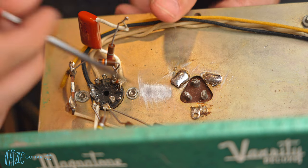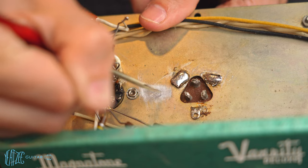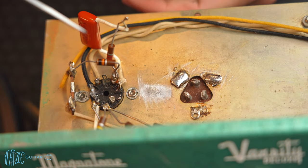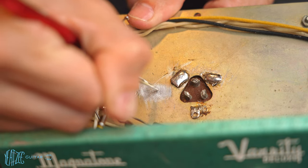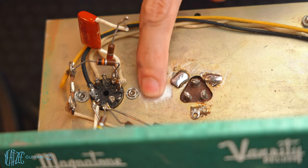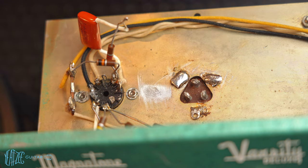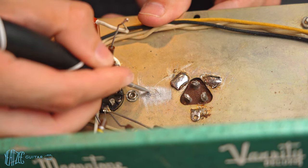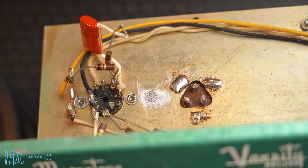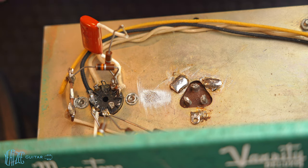Then I'm gonna go ahead and scratch it up a little bit. So my goal is just to create a really good surface for soldering. I'm gonna give plenty for the solder to catch on to here. So get some various tools and just kind of scratch it up. All right, that should be good, I think. And then last but not least, Zippo lighter fluid. I use this to clean stuff all the time. So that just should clean out all of the remaining oils and stuff here.